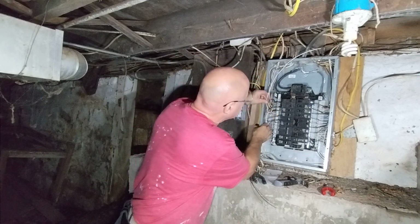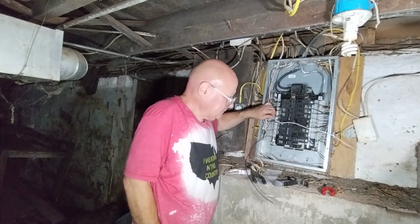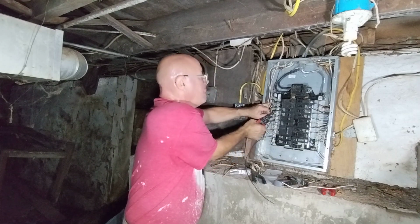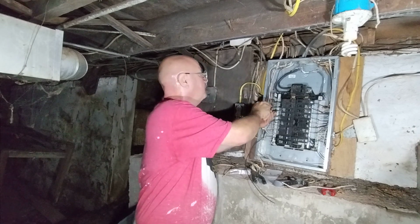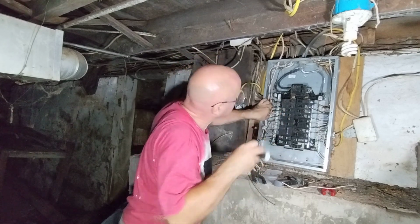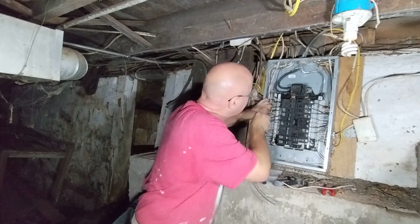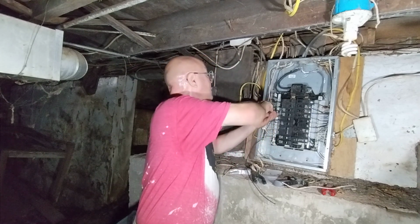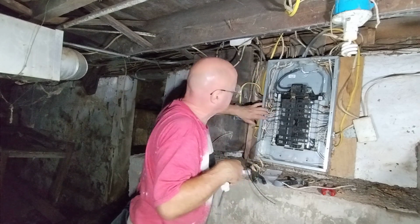Now we'll grab our white wire, we'll put it on the neutral bar, we'll go up to this terminal right here, and we'll cut it about right here. Make sure our insulation's not pinched under the terminal. Gotta get the copper through all the way, so I see it on both ends there. Push it back so it's nice and neat and going straight into the bar. I see some copper behind it and the copper on the other side.